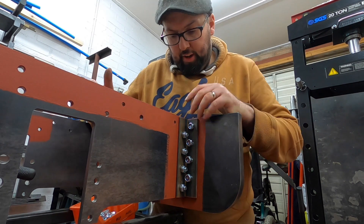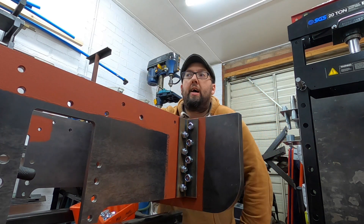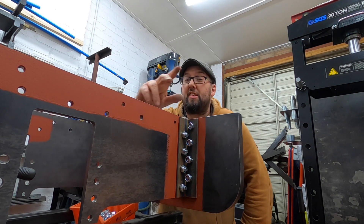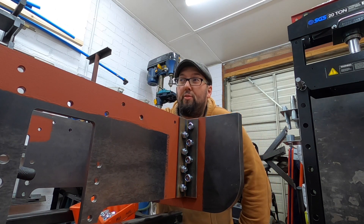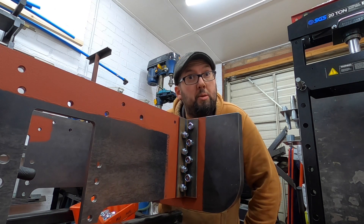So that's all the nuts and bolts in, so now I just need to go around and tighten them up and then we'll have a little measure and see how square it is. It should be square because we machined these angles, and the plates look reasonably straight.